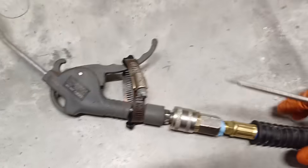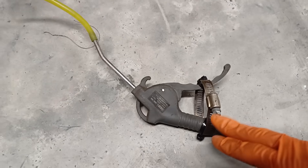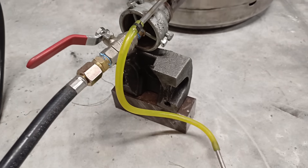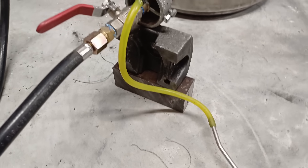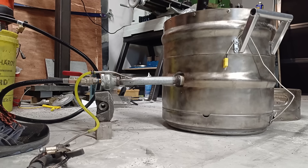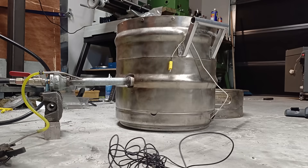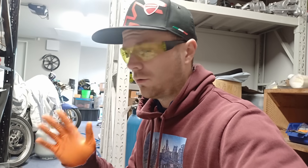I'm going to have a go at tuning the burner while the kiln is heating up. This is my makeshift air regulator — essentially I just tighten that and the more I tighten it, it puts more air in, so it's pretty straightforward. I'm going to light the torch and see how much air I can add before it doesn't want to run, then wind it back a tad. It seems to be burning pretty clean, so that's good.